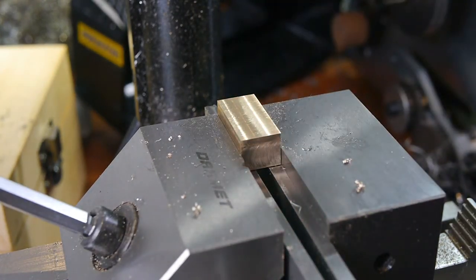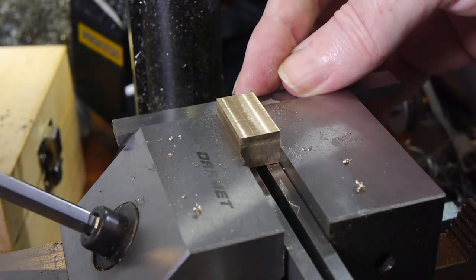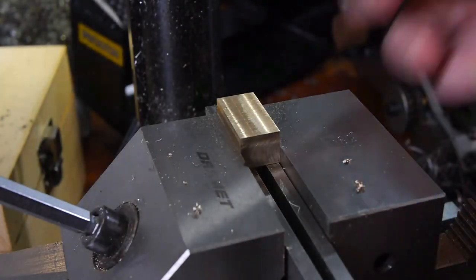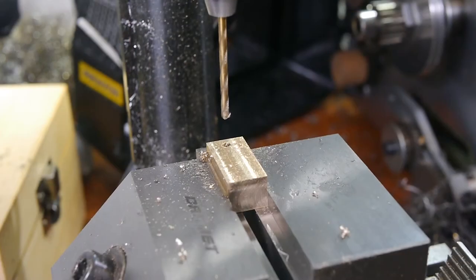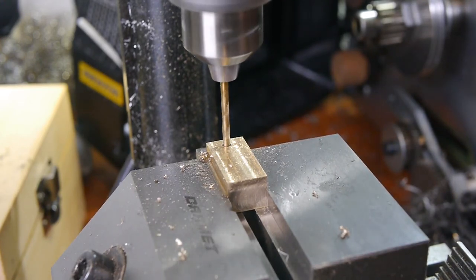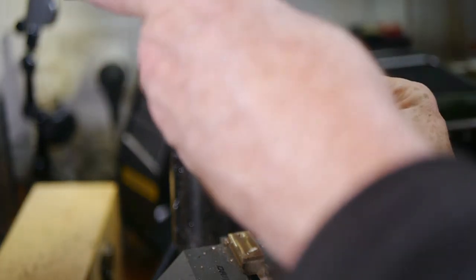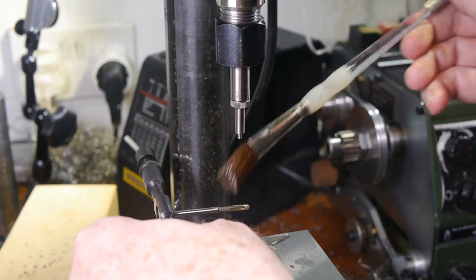With the table still locked in the same position, I set up the lower jaw to drill the equivalent tapped hole for the aligning thumbscrew. This was an ideal job for my recent shop-made tap follower, especially as this M3 tap requires the specially made narrow tooltip.